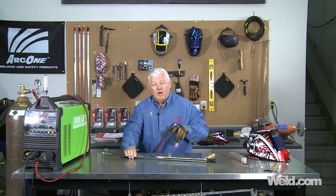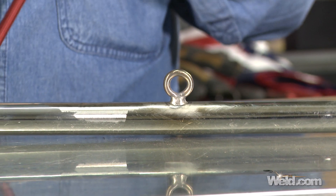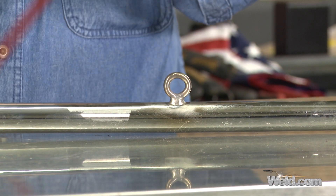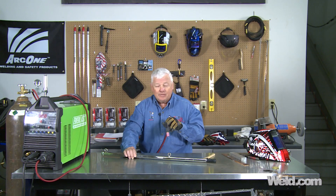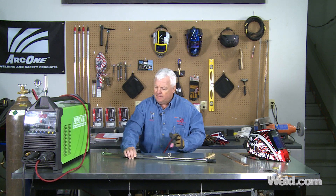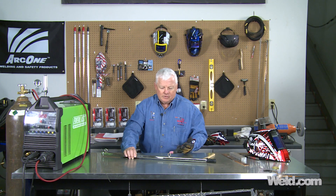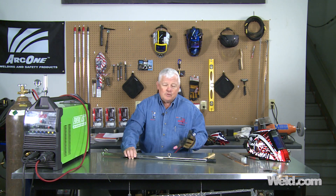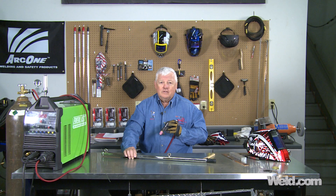Now that we've welded it in place, it's going to leave a lot of bluing, especially when you're just in an isolated area — you'll see the heat build up a lot. So just weld a little bit, add a little bit of filler, let it cool down, and you'll have a lot of starts and stops on this thing. We've got it in place, we've got the right dimensions. We're going to reattach the flag and send it back to Kathy. Kathy, thank you for writing in to us, and thank you for watching TIG Time. I'm Mr. TIG.